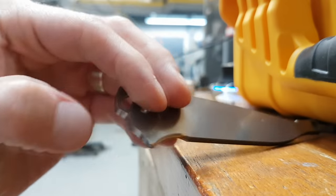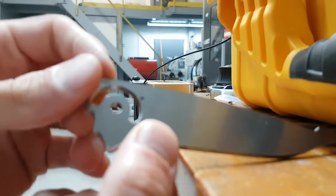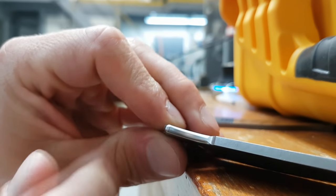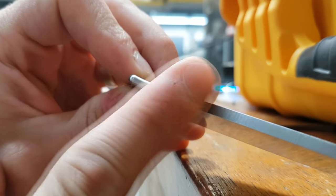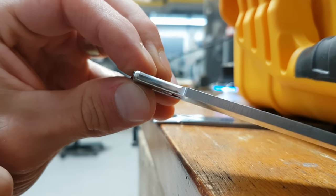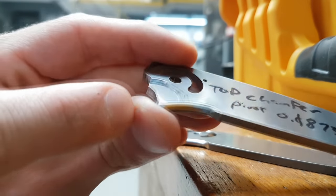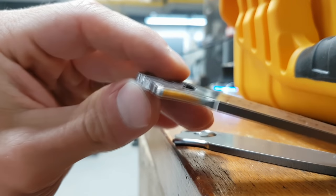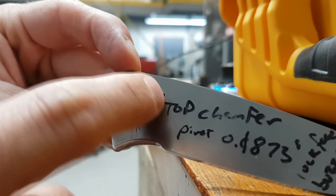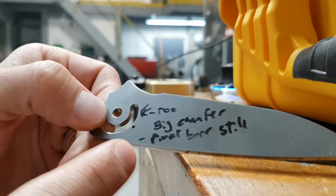I'm just about very, very happy with how these are turning out. Little chamfer inside there, little chamfer through the pivot. I kind of screwed up in here with the corner rounder — there's still a flat on the vertical flat area; the corner rounder isn't getting all the way in there. So I just need to make sure it moves over more. And like, this is the very first one I did. You can see I crashed the tool here because when I drilled the jimping, I accidentally set the bottom plane to like negative six inches or something. I tried to drill all the way through the part, through the table, and luckily the Mori stopped it. There's no chamfer in here, pivot was a little bit under, lock face buzzes — all these little notes I write to myself.